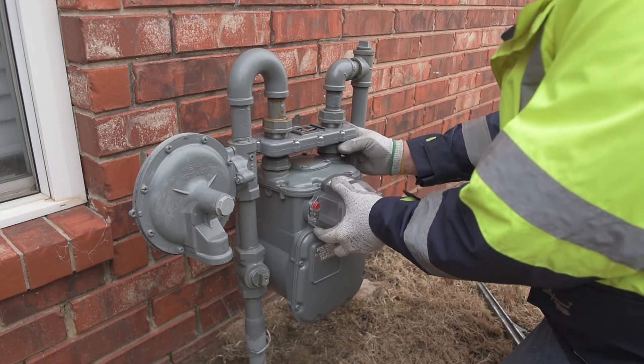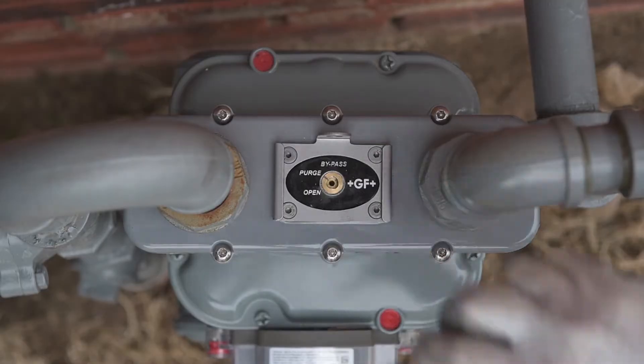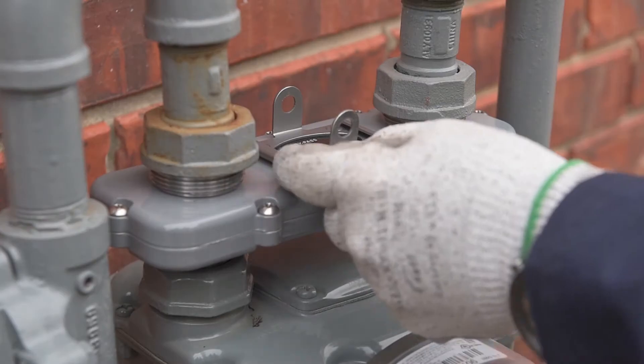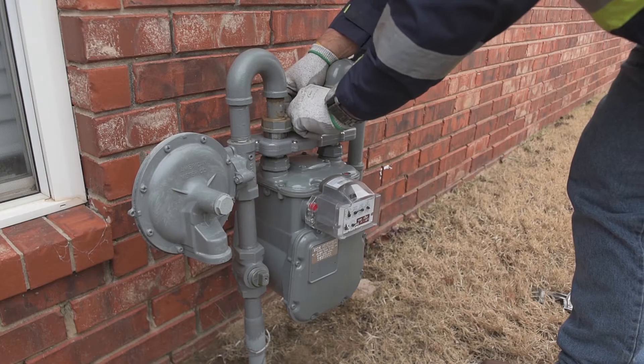Connect the Co-Pilot's outlet nut, along with the appropriate gasket, to the meter and snug both the inlet and outlet to seal. Turn the Co-Pilot's security key back to the open position. Reconnect the security cover plate and lock with the meter owner's approved locking device. The bypass process is complete.